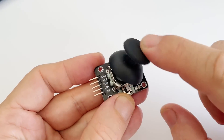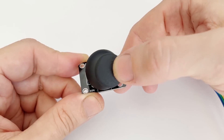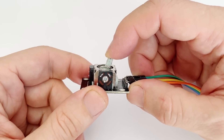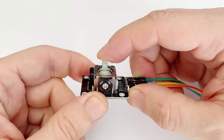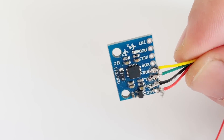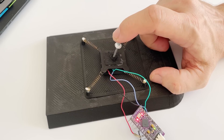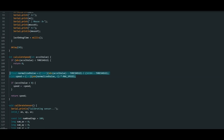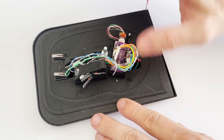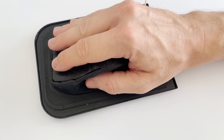Now the mouse needed to stay stationary. I had the idea to use a joystick and mount the mouse on it, and tried a joystick connected via Arduino — but control was inconvenient due to the dead zone and the need to apply force for movement. Then I decided to use a gyroscope, attaching it with rubber bands. This made the control smooth and pleasant, but the cursor speed was still low. I solved this by adjusting cursor speed based on the tilt angle: the greater the angle, the faster the cursor. However, it was still uncomfortable to control because the hand was used to moving with some rotation, which wasn't possible with this method. I had to abandon this idea.